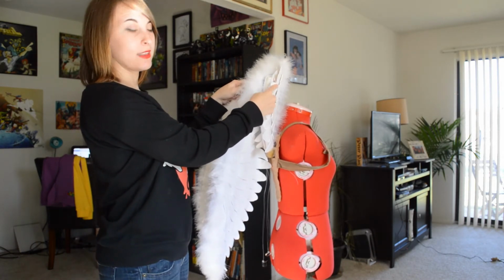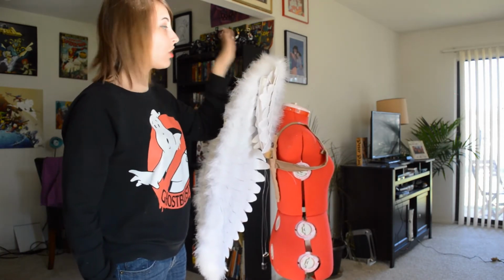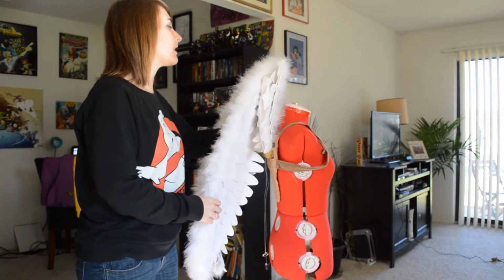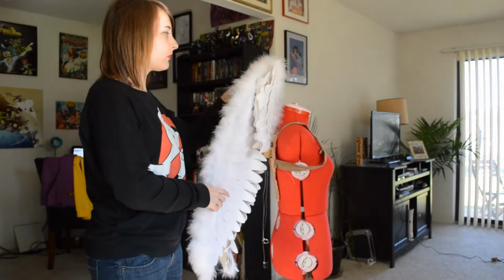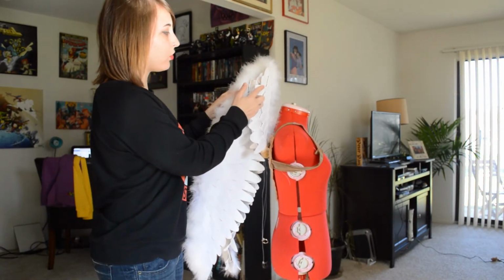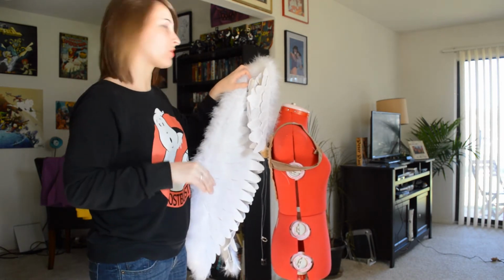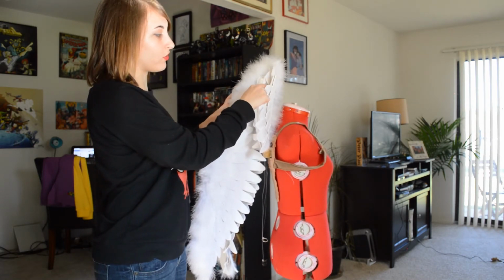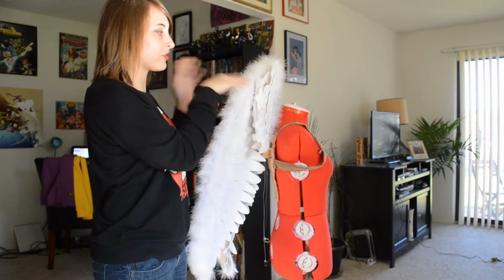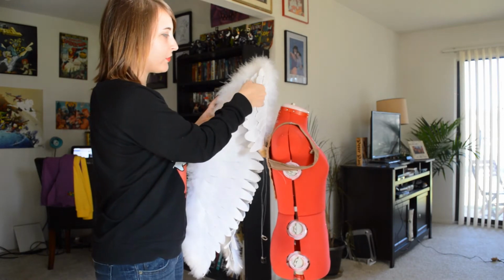This is the hinge. You want there to be an extra 5 inches or so past the hinge on the outside wing, because this is going to create the leverage you need when you're opening and shutting them. So you want to get a bolt. You're going to want to put some washers in between to make up any of that extra space. I used about 4 or 5 on each side. And you are going to want to cover the bolt with the Gorilla epoxy, just the bolt. Make sure you don't get it on the nuts on the end, to make sure they don't move.